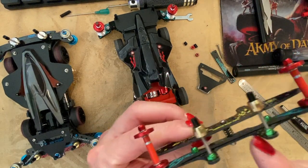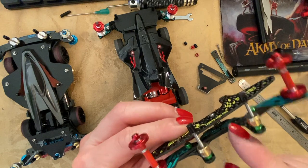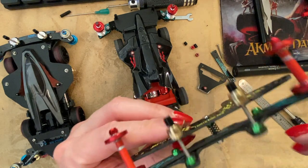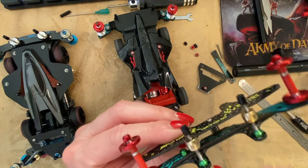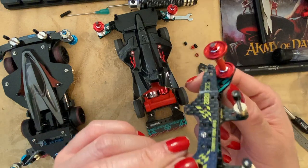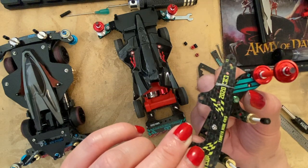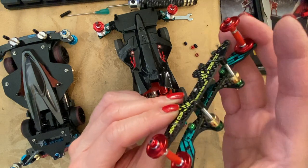The chandelier pivot has the pivoting part suspended by a post — by a screw — with the lock nut in place and a spring. I could also replace the spring with a mushroom cap or a spring with an end cap. If you have a spring end cap on this, then it only moves clockwise and counterclockwise. So you can either have it move in a unidirectional way, or you can have it as a free-form pivot like I have right now with the spring or with the mushroom cap.